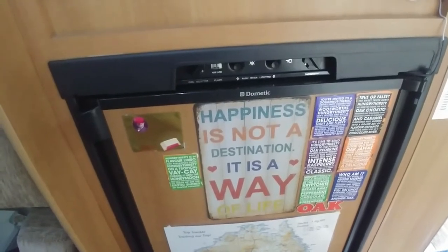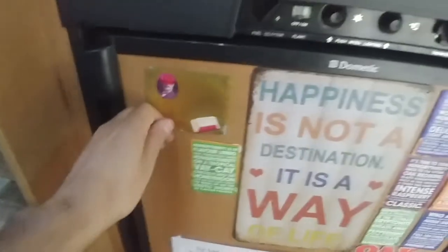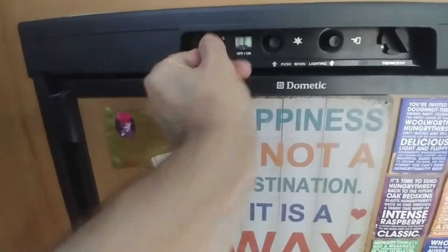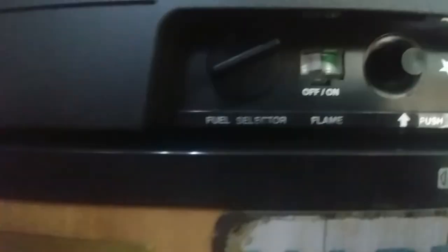We've got a 150-litre Dometic absorption fridge, a three-way unit. If we have a look at the power placard on the inside, it says that for 230 to 240 volts it's only drawing 0.8 of an amp, or 195 watts. Since this is a 1200 watt inverter, it's quite easy to power the fridge off the batteries. So that's switched from gas and is now running on AC.